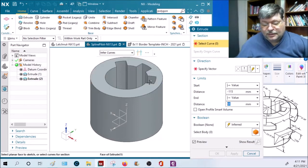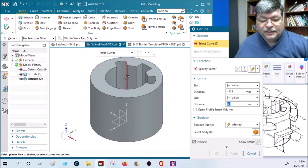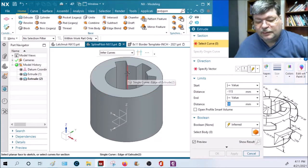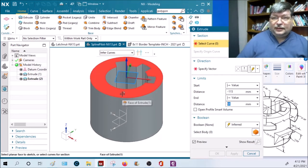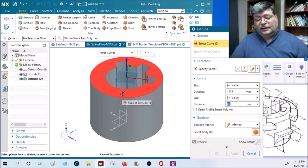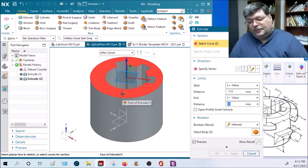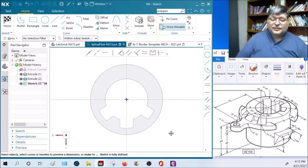I'm going to do everything from the bottom plane. If you pick a face that has cuts on it, notice every time I pick it, it creates a new coordinate system - the coordinates aren't pointing the right way. When you pick a round plane it looks for some straight line and tries to put a new coordinate system on you. You don't want the front to change 35 degrees or something - to keep that from happening, pick the same datum plane.